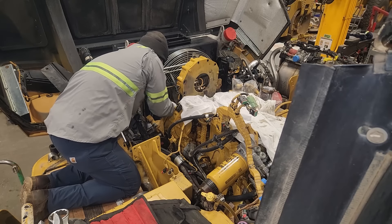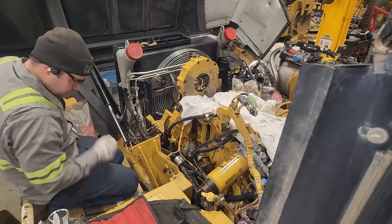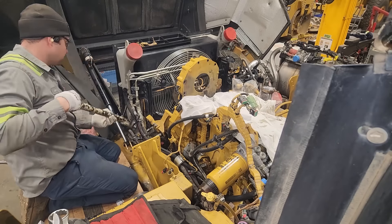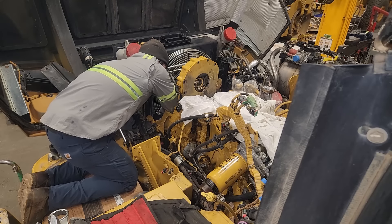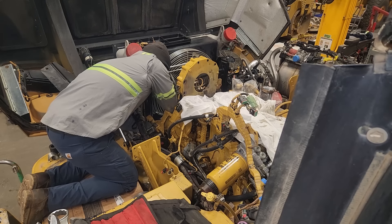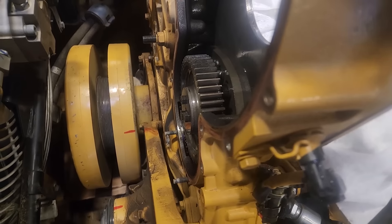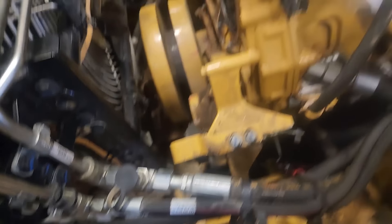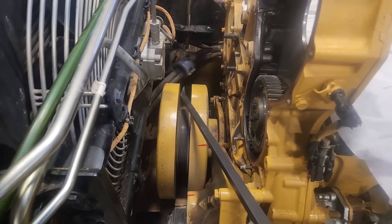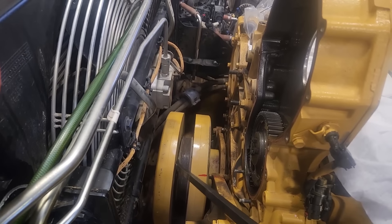What I'm going to try to do is not pull the AC compressor - I just have to unbolt it from the bracket. The AC compressor bolts are almost impossible to get to from where I'm at, which is the left side of the engine. But if you pull the belly pan down, which we had to do to get the oil pan off, you can get the AC compressor bolts - way, way easier. So these are the bolts - there's about five million of them that hold the damper assembly in. It's kind of a sandwich - a damper pulley damper sandwich. All the bolts hold them all together, and then you have your drive unit, which has separate bolts. This thing is heavy - it says it weighs about 100 pounds, and I totally believe that. I used the crane to get it out of there. But once we got the bolts out, I put some cardboard under it just so it wouldn't damage anything. Came right off.